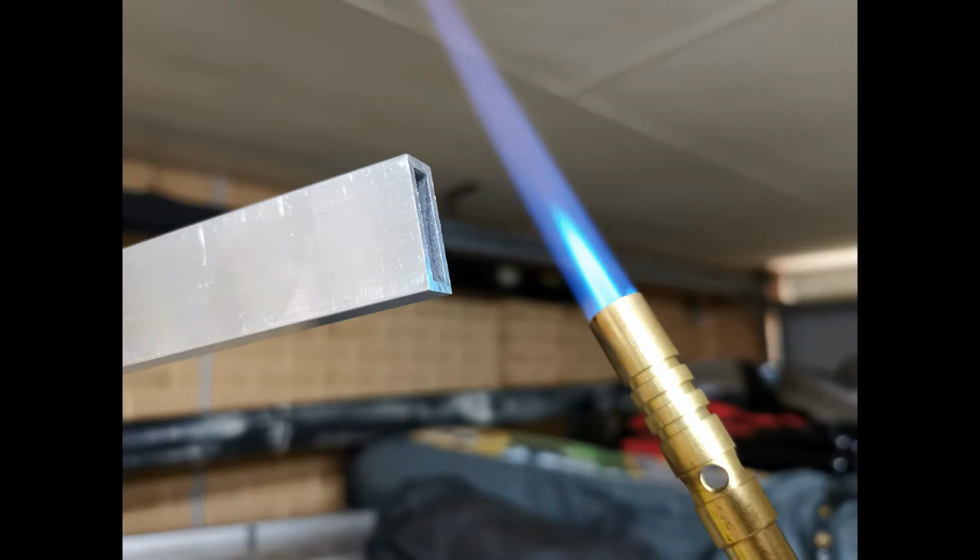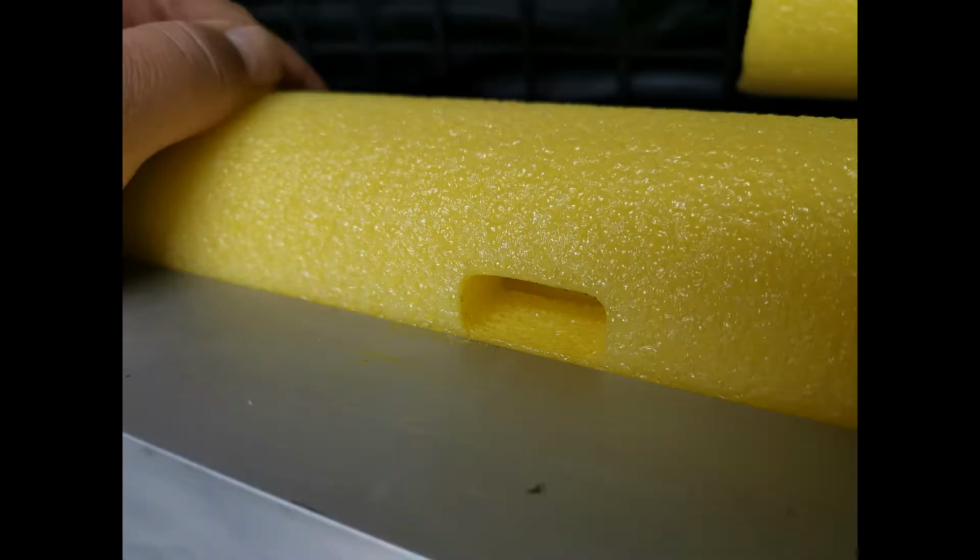And then that's just the hole that I drilled through to match the bolt size. Get something hot and heat up the end of your 60 centimeter aluminium piece, and then push it through the side of the pool tube perpendicular to where you just drilled the holes. So the hole's on the top, and at 3 o'clock the bar will be pushed through like that. Have a guess where the bolt's going to go through and mark it, and then just adjust it as you need be until the bar sits central in the tube.